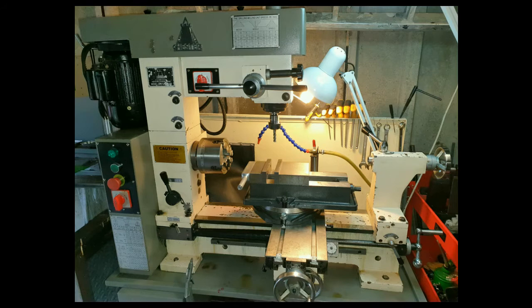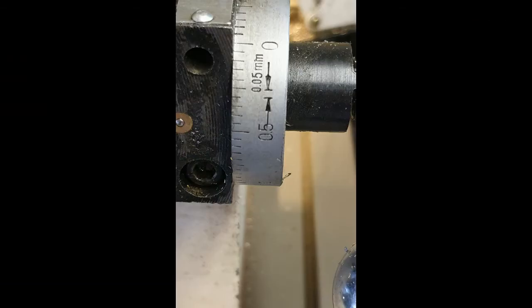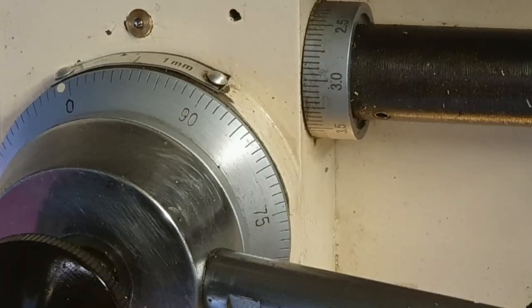Other features were the distance between centers — when would I actually put a 0.5 meter piece of steel in for turning? Not very often. A good function of this machine is it can turn threads in both metric and imperial, achieved by changing the gear ratios at the side of the machine. All the dials are set up to work in metric, down to a hundredth of a millimeter tolerance. Regarding the mill and drill press, the speeds vary from 3000 RPM down to 125, achieved by modifying the pulley arrangement, with tolerances again down to one hundredth of a millimeter.